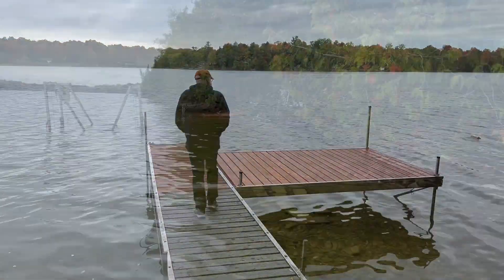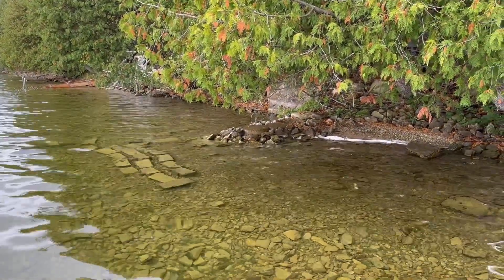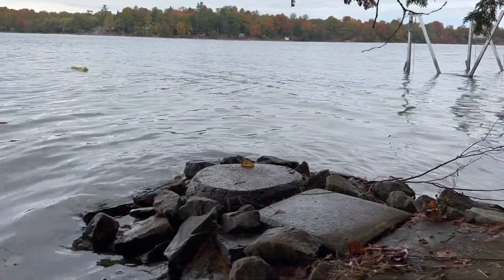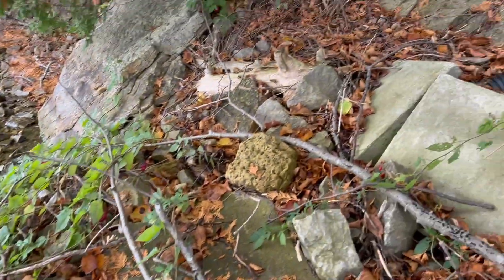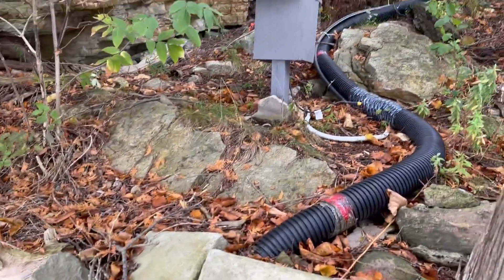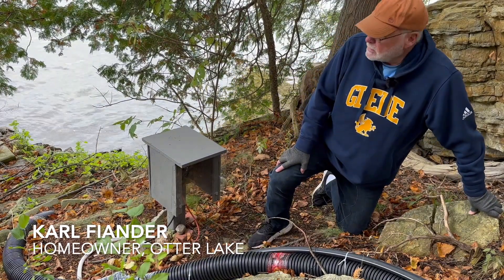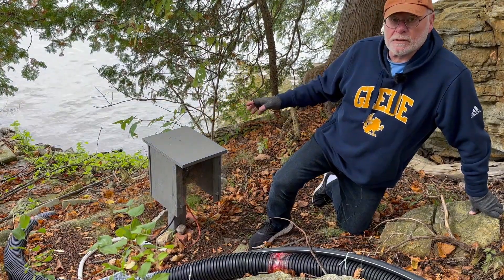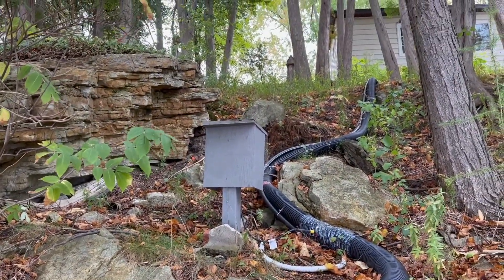What we're looking at right now is the entrance of the main pipe into the lake. The submersible pump is about 30 feet out from the shoreline in about six feet of water. It runs underneath the stone and emerges from the shoreline right here. What you see here is the power supply for heat cable, so that keeps the line free in the spring and the fall, and then from here it's just clear pipe all the way up to the house.